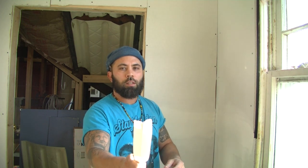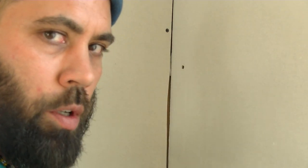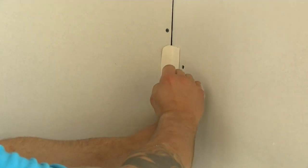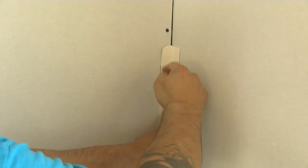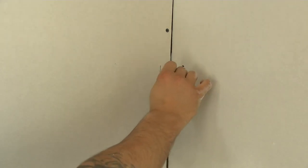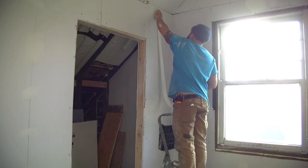None of that other nonsense — just cheap paper tape. I use a six-inch and a four-inch knife. I'm bringing you in real close just to show you — see where that tape is, how it'll fit in there dry. I'm putting a little mark here — 'little Marky Mark' — to demonstrate: where the end of the tape is, you need mud out there and mud about there in order to get enough for the paper to stick, because if you don't have enough mud fully behind it you're going to get little bubbles, and bubbles equals troubles. Before I apply any mud I make sure I have the correct length of paper tape.